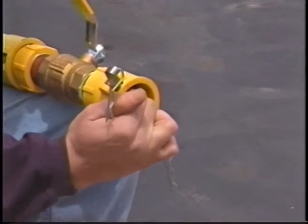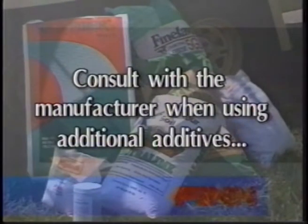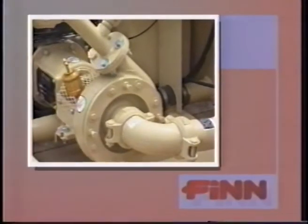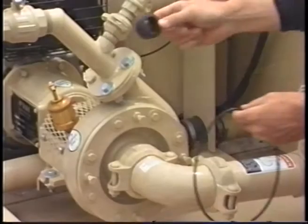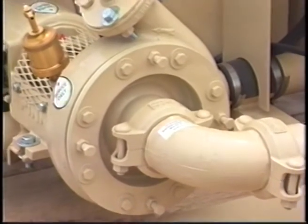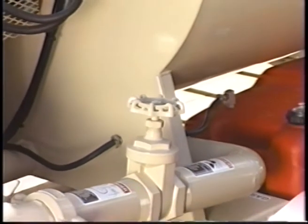If your machine should have a tendency to jump or excessively vibrate, it could be either a bent paddle or agitator. Bent paddles may happen when loading mulch in before the tank is half full, and agitators tend to get bent if large objects fall on them. In either case, the bent piece should be straightened for the machine to again run true. When the pump loses prime or spray lacks distance, there may be a problem with the suction within the system. This could be the effect of air in the suction lines. Check the suction connections to see that the rubber seals are in good shape. Grease the seals before replacing the clamps. Lack of distance may also be caused by low RPMs. Check throttle cables and reset to a higher setting. These could also be symptomatic of the pump or nozzle being worn, or the suction being partially plugged. Use procedures outlined earlier to address these issues.